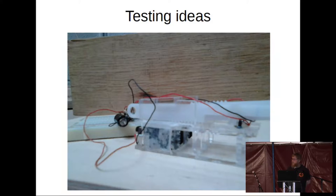For each idea we have, we've had to test it. We're testing a rack and motor mechanism here — moving from solenoids to more controllable motors. When we produce things like this, we set them going with some kind of feedback — whether optical with a Raspberry Pi camera or contact switches — and leave them running for several days to prove the idea is going to be successful. This is one of many prototypes and mock-ups we've had to make.